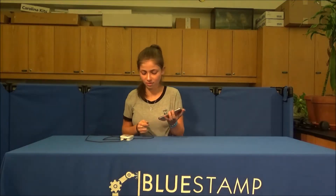Charges. So, I just started out with a circuit board. And then I added on resistors, which sped it up, so that it could tell what type of charger was being plugged in. Then I added in a ceramic capacitor, which stabilizes the Boost converter chip. And then I added in a diode, which makes sure that the energy goes from the battery to the USB port and not the other way around.